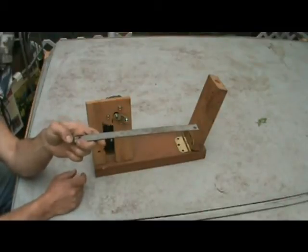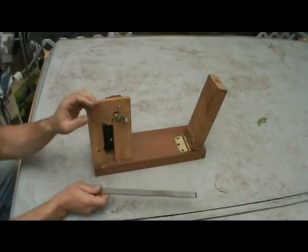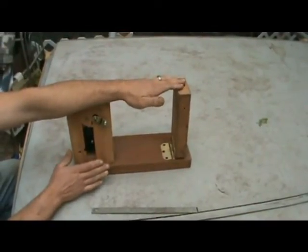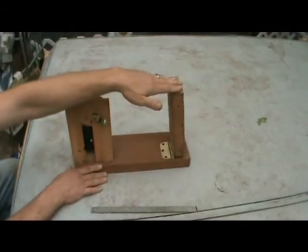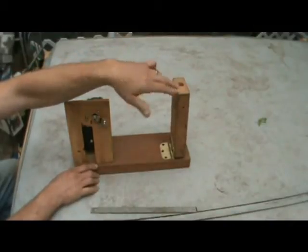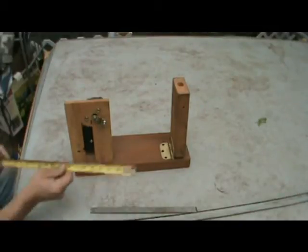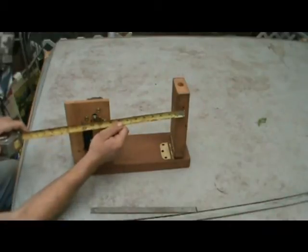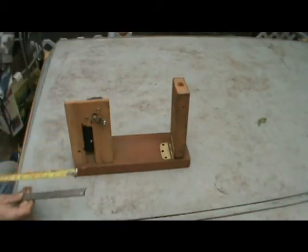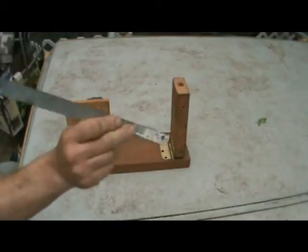Some people don't like working with metal, and that's fine. So you're going to start by measuring out what we need to do, and you should get pretty close to the same measurements that I did, if you've built this the same way I did. Move this into approximately the straight up and down location. Okay, no need to get out levels or anything like that. It's not that precise. Get that in approximately the straight up and down position. Measure from approximately the center of this board to the center of your wiper motor. Got 11 inches. So you're going to need a bar that's about 12 inches long with each hole at about 11 inches.